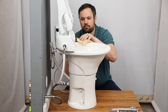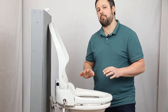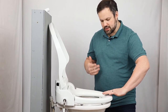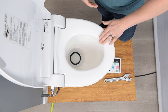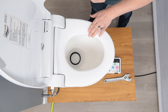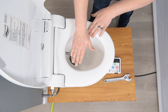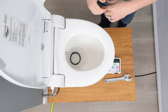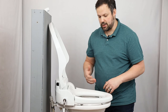Now we'll want to check the Cascade itself. When testing it, it's important to remember to activate the seat sensor to do a proper test. If you don't activate the seat sensor, the seat won't work — and the seat's probably not broken, it's just not activated. This keeps you from running a wash accidentally when you're not seated on the unit. To do this, start with your hand in the middle of the seat and work to the right until you hear the self-cleaning cycle start, which tells us the seat sensor is now activated. Now we can hit the wash button and we can see that the wash starts — we know it works. Once I remove my hand from the seat sensor, the wash stops because that's a safety feature and the nozzle retracts.